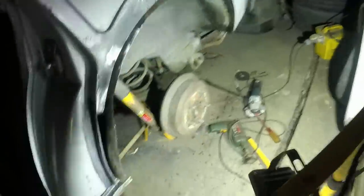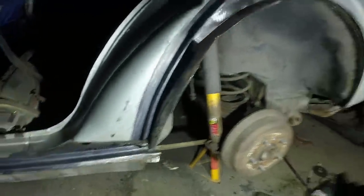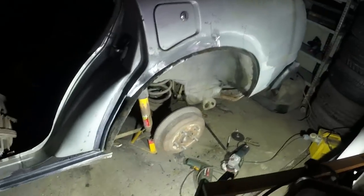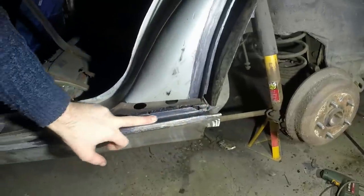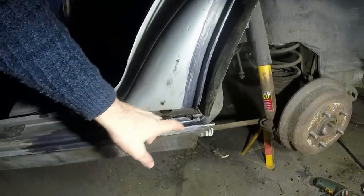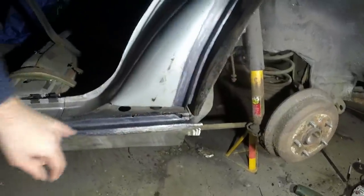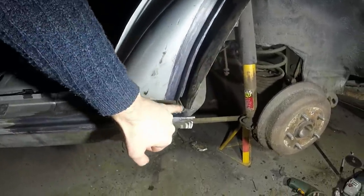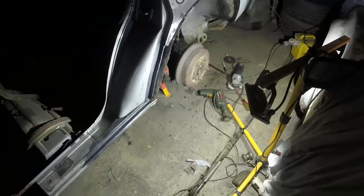The Hydrate 80 that I put on in this area is all fully gone off. I've got most of the panel trimmed up how I need it, but I need to repair this section next. I'm going to see what access is like when I'm actually holding grinders in there, but the plan is to cut all of that out and then use that panel I made up the other day as a repair section, because I won't be using it for the B pillar.